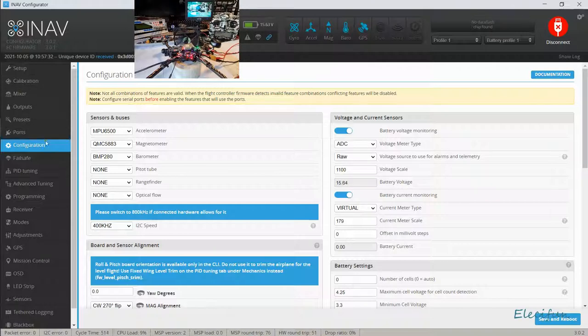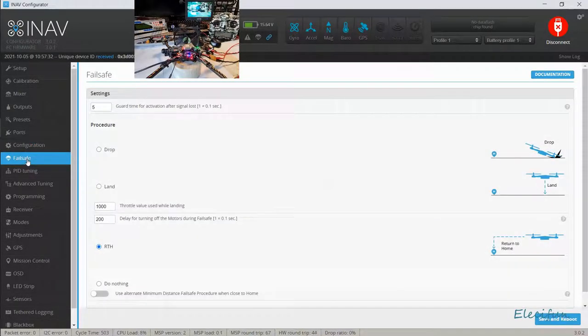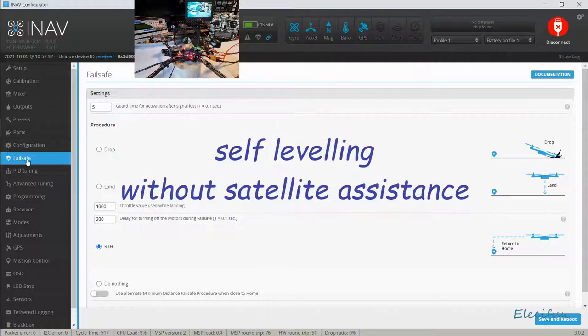We've got a failsafe. This is an absolute must. You've got to get it set up, but do not have a badly set up craft and then rely on things like return to home to work. That's not how it's going to work properly. You're going to set your craft up first. You're going to get it set up, get it flying, within the bounds of the firmware, within your skills, and then you can be ensuring that your automated system is working. But you need your bird working pretty much manually to start off with.